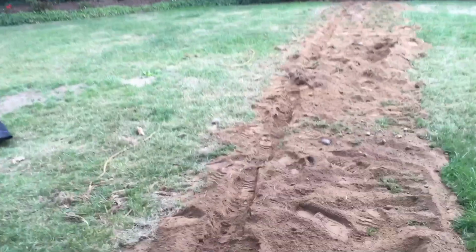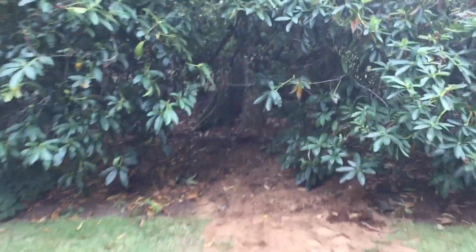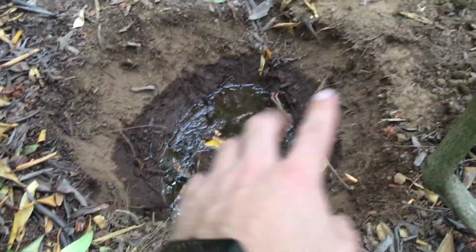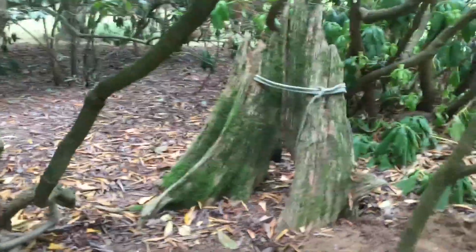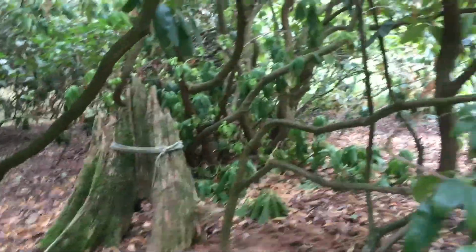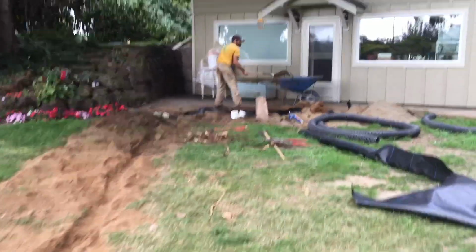And you can see what happens. It goes all the way down here, this PVC pipe, and it's draining out, had a couple feet of fall, and it's gonna go down to this hole, other end of the PVC pipe. We're gonna line this, put a bunch of cobbles, and then what'll happen is, since this is on a nice slope downwards, it'll just kind of wash down into this bed, into the field, and they won't have any more standing water here in this backyard.